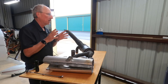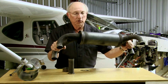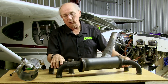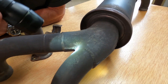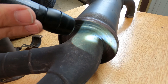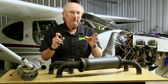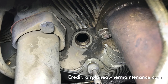There are things you want to inspect to make sure you don't have exhaust leaks. When you have a chance to inspect your exhaust system with it really opened up like this, you want to take a look at all the welds, because it's very common to find cracks at welds. Look very carefully in the weld and just on the edge of the weld for anything that's a crack. A good indicator that you have a crack is that you'll have a little exhaust stain.